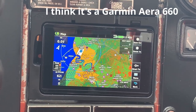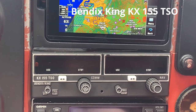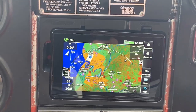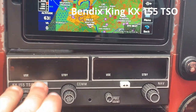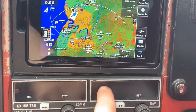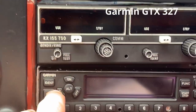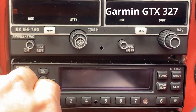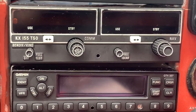On the Cessna, I have a Garmin GPS — it's a nice little GPS. Below that we have a dual radio with a frequency and standby frequency on each side. This side is used for our VOR and this side is our COM. Right here is our transponder — I either hit VFR to squawk VFR codes or I can enter my code manually. That's my radio stack.